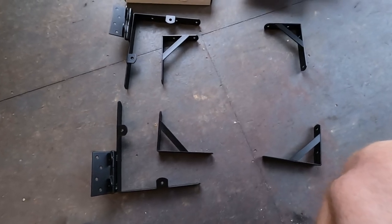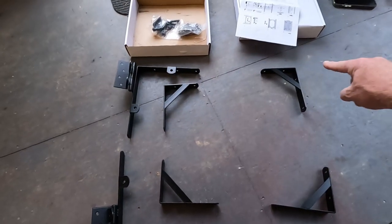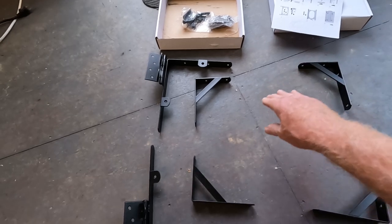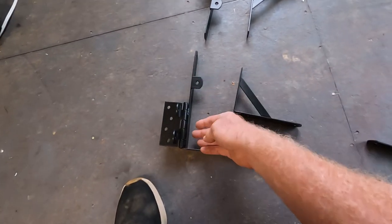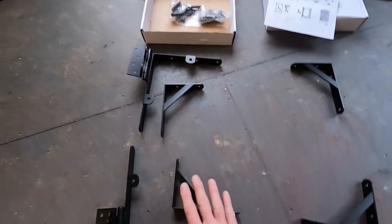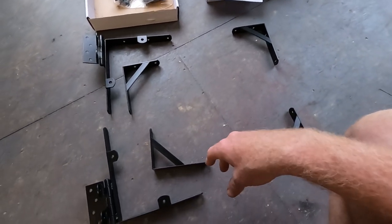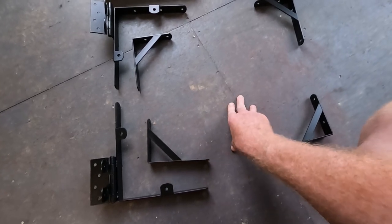Now the hard part: the gate. With the gate, I'm going to cheat a little bit. I bought a kit on Amazon and it actually allowed me to make two different gates with the same hardware. What you're doing is making a 2x4 frame that's the exact width of your gate. You can make a traditional gate — a 2x4, 2x4, and then have a 45-degree bar that comes down and supports it, then put the hinges on it. I like this kit a little bit better because it has the hinges and a frame that surrounds the 2x4, so you can build it up and build it across. I'll give you the link for this down in the description. This is what I'm going to use to make gate number one on the left side and gate number two on the right side — that'll give me two four-foot gates. I was going to do one eight-foot gate, but I just don't have the structural soundness I would need to support that much weight.